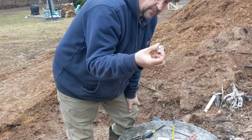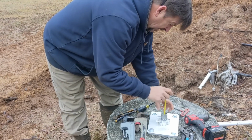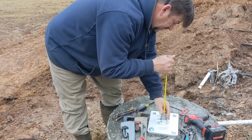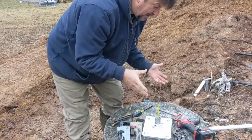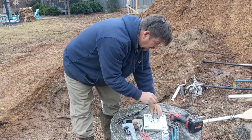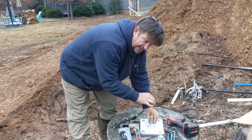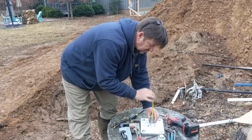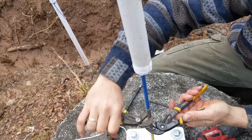So, and the rod guide, we put that over the sucker rod, and that keeps that nice and centered. So not in water yet. And you can feel it when you're like, where am I? I don't know where I'm at. Am I in water yet or not? You can feel it, and you can hear the check valve ratcheting when you're in water, and you'll see it'll pop right up too.